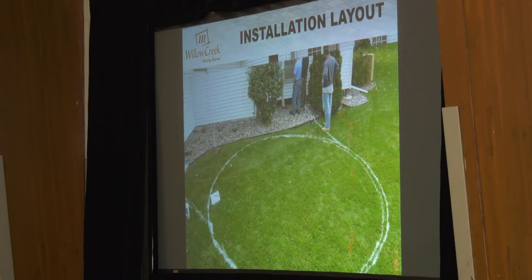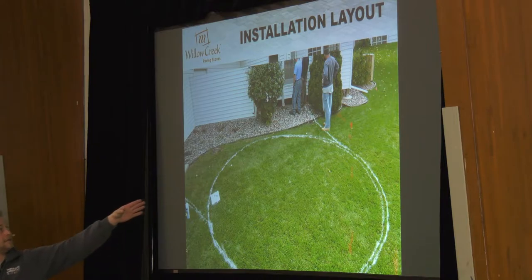She's marking up the perimeter, and these lines right here denote the edge of the patio. We're going to have to clear out some rock on this one. Notice there's a flag that looks like it's probably marking an electrical line. Make sure that before you start digging for your paver project, call Gopher State One. Make sure that everything is marked up. If you ever hit a gas line, you'll call every time from there forward.